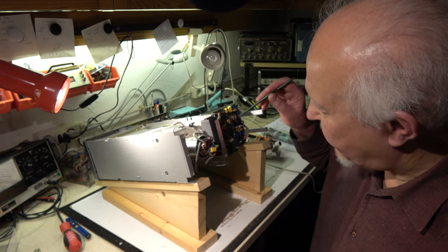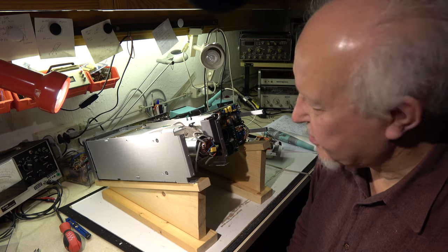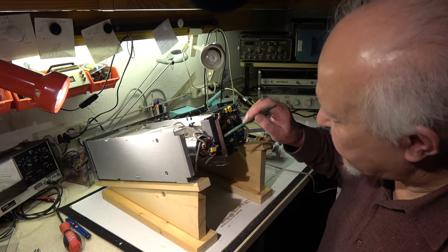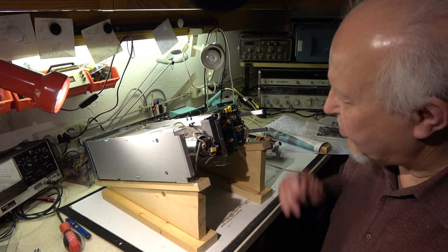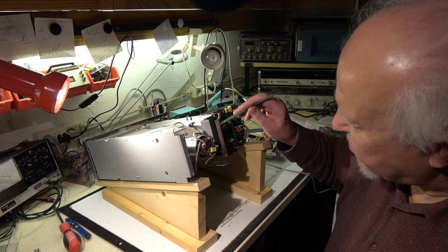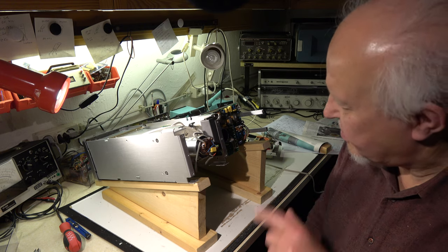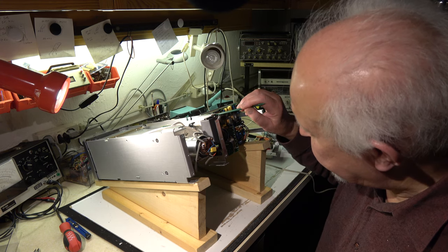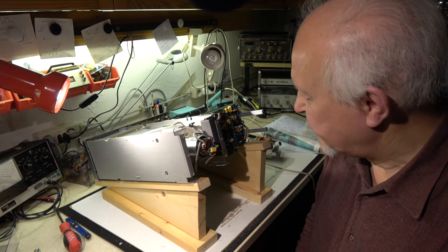In the following sequence I show repainting this cascade with graphite. I forgot to switch on the microphone — operator error — but it's self-explaining. I used graphite spray, but not directly as a spray. I sprayed it into a small box and applied it mechanically. It dried out very rapidly within a few minutes. Important is to have good contacts where the plastic snaps onto the aluminum frame for proper shielding.